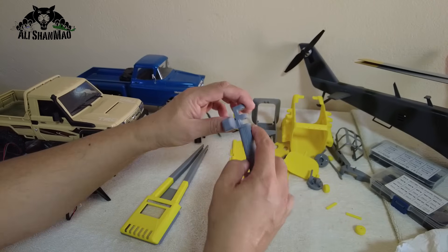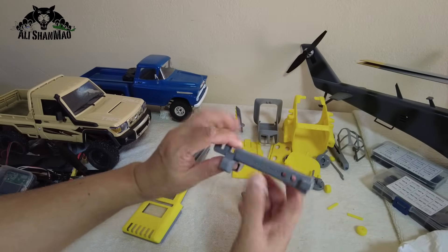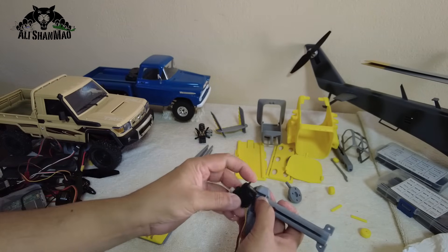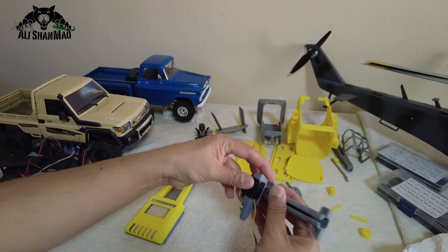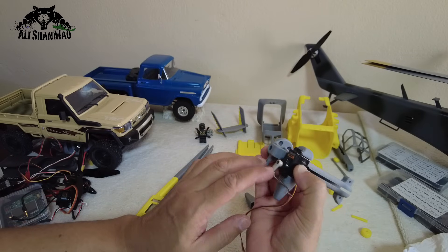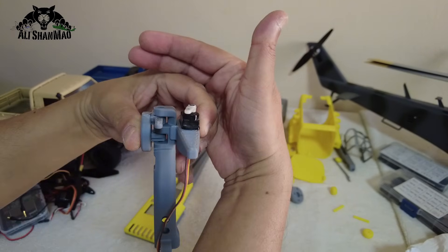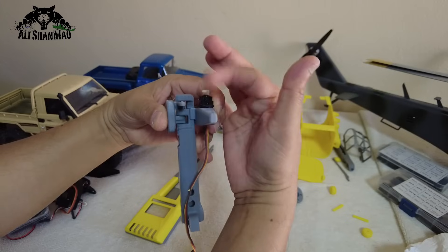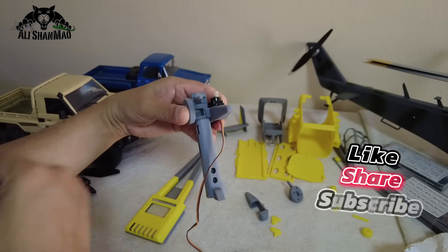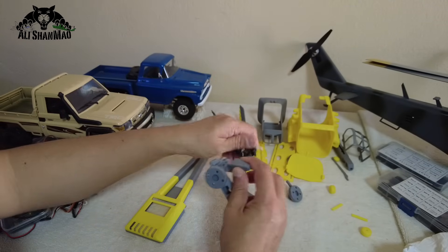The other parts to glue are the servos. Before you glue the servos, the fuel tank-type servo holders — give you a quick overview. Put a servo in one of these servo holders and match where the horn will be closer. If you install it too far down, they go way too far from each other and are not parallel. Make sure you align them as parallel as possible, then glue the servo holder.